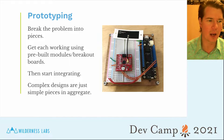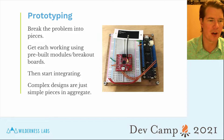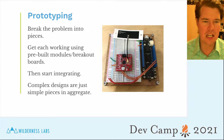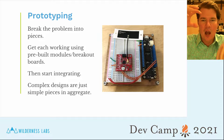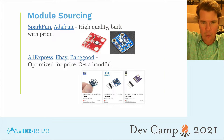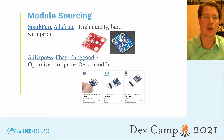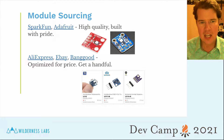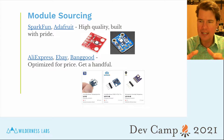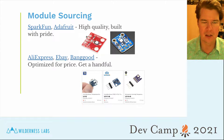As you're solving those pieces, I highly recommend using modules — prebuilt modules that you can get off SparkFun or Adafruit. Oftentimes even the most complex designs are really just a bunch of simpler pieces put together in aggregate. These modules are a great way to start prototyping because they've taken the essential piece — say a motor controller or a sensor — added the requisite components needed for it to work, put a header on it, making it easy for breadboarding or even a custom PCB.